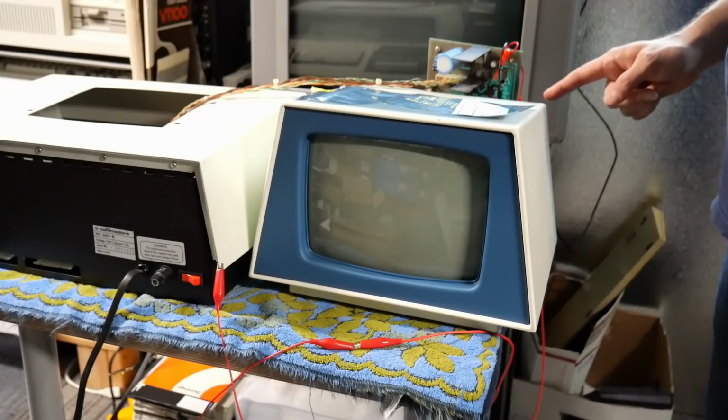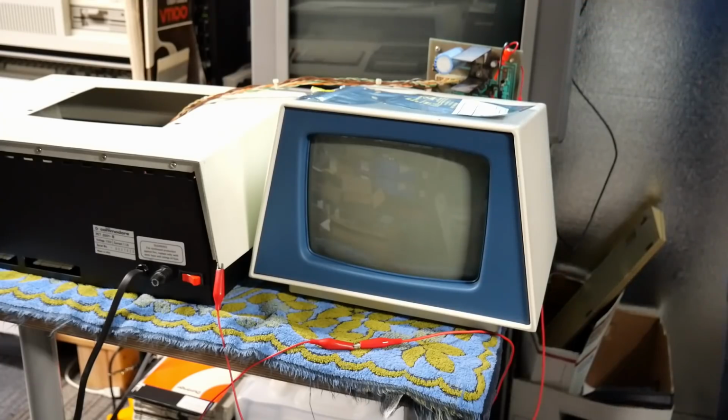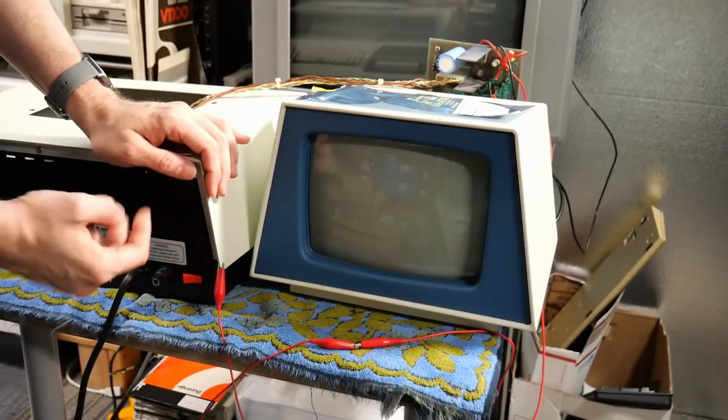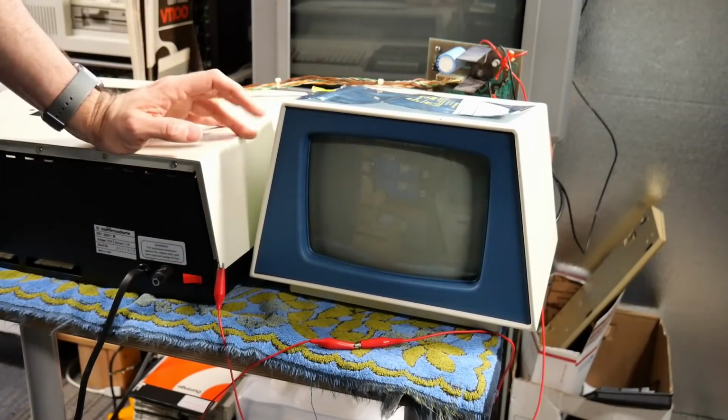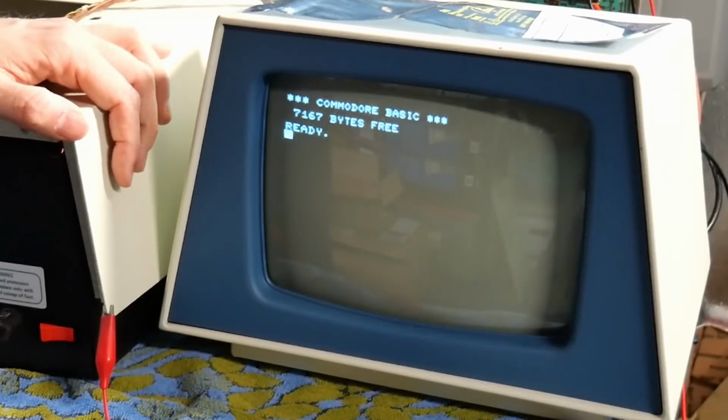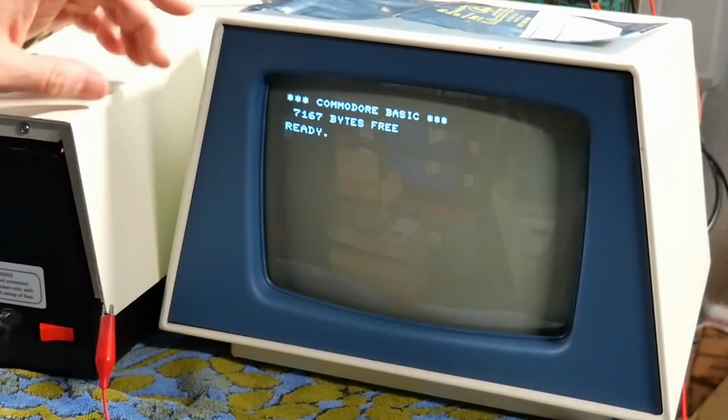I'm going to quickly swap back in the original transistor, and I'm going to take this potentiometer out. All right, let's turn it on. I expect the picture quality to be back to normal. Yep, okay, that looks really good. Remember, I have the Vishay diode still clipped in.